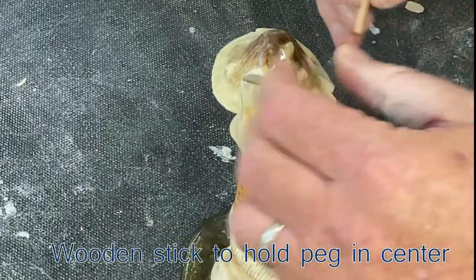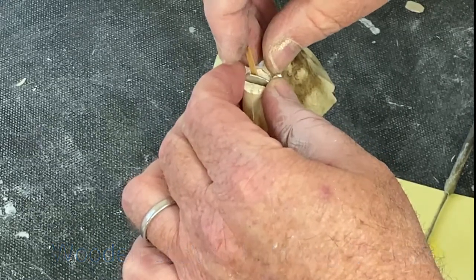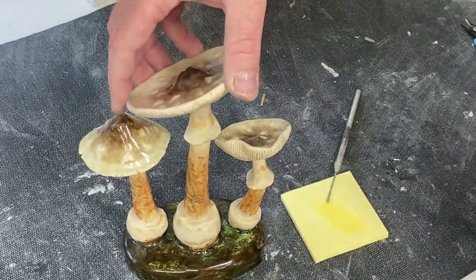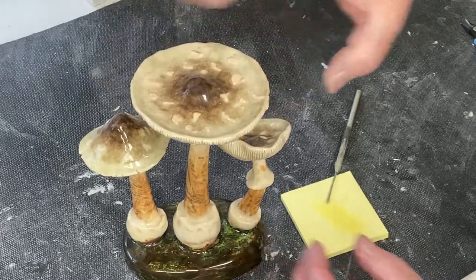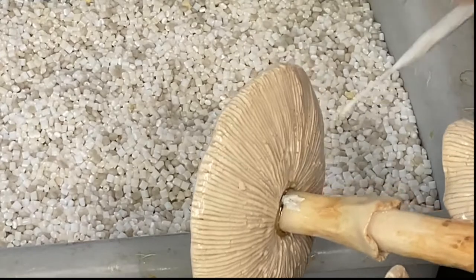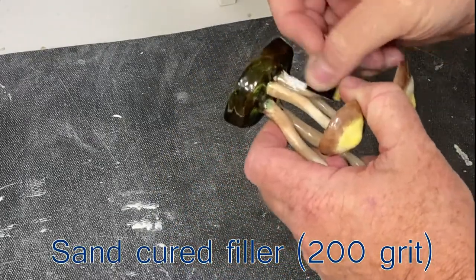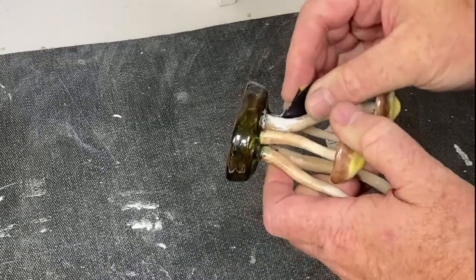Here is the piece of wood I was talking about. Apply epoxy on all surfaces — make sure you don't wipe it off. Just let it cure where it is. Even when it drips, don't wipe it off. I don't need the pebbles this time. Here is the PC epoxy filler — it's PC11 PC epoxy. I'm sanding it, starting with 200 grit, then going to 400 grit for finer surfaces, which would be sufficient for paint preparation.